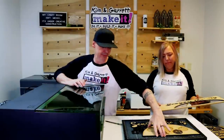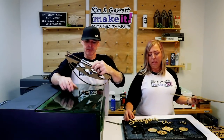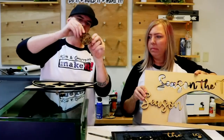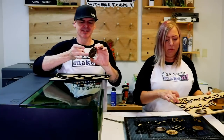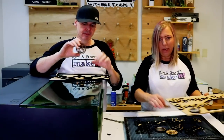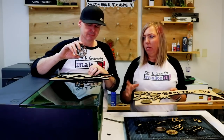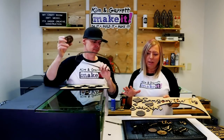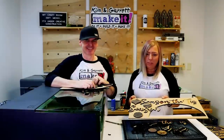These pieces get a little intricate too, but they came out great. I am shocked that this diode laser is getting through quarter-inch material so fast and so clean. I was a little worried after the first conveyor feed run, but no — it's still great. I just needed to learn that the smoke required me to either increase the power or slow the speed down a little bit.